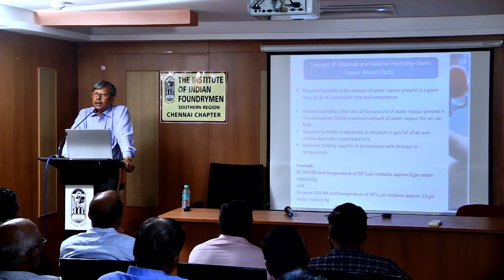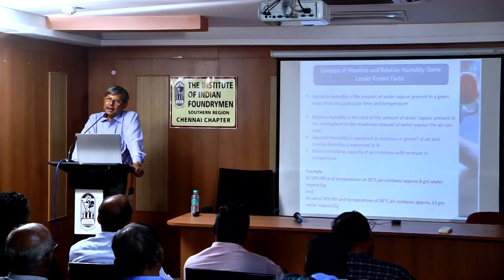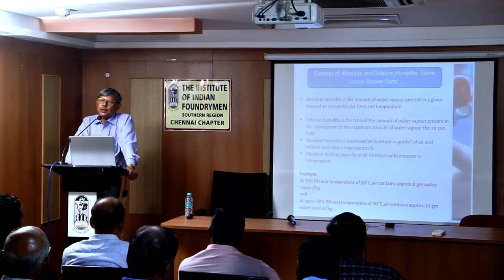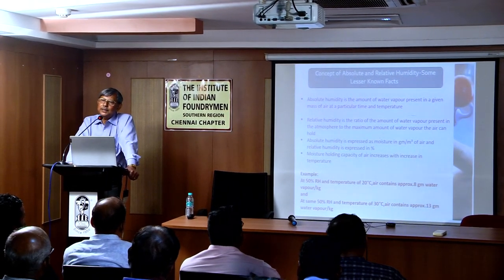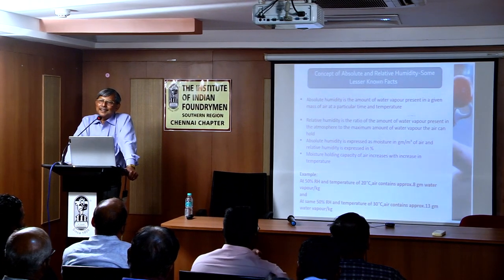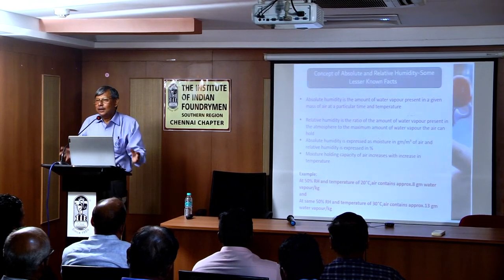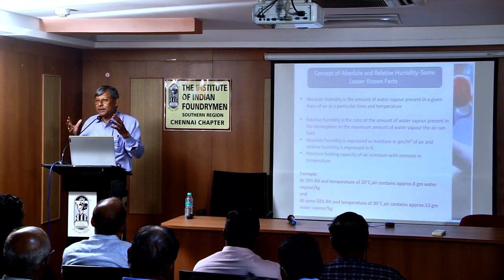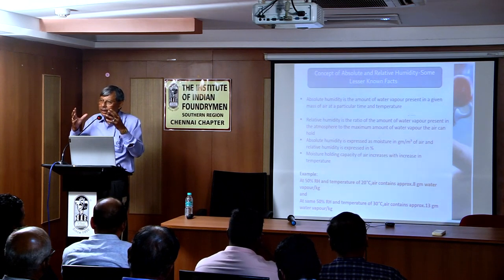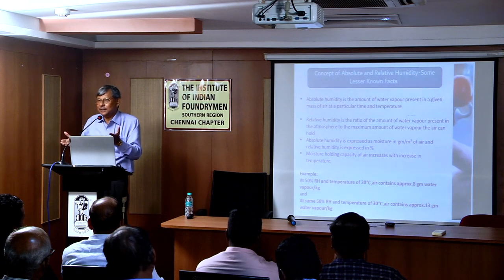Suppose you have two temperatures. Today it is 30 degrees centigrade and your relative humidity is 50%. And tomorrow it is 20 degrees centigrade and the relative humidity is the same, 50%. Which is more detrimental? More detrimental is 30 degrees centigrade, because although humidity is 50%, the moisture content of the air is much more. It is almost double what it is at 20 degrees centigrade.